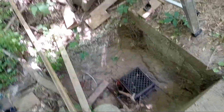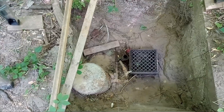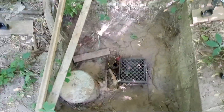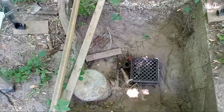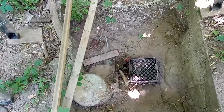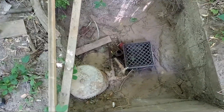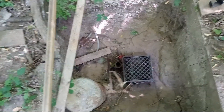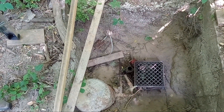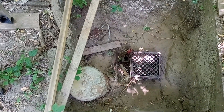Back to the well project. I've been doing a little measuring. I dropped a string with a weight down there and the well is actually 80 feet deep, on the nose — plus or minus an inch. That 80 feet is to the top of what's exposed, so technically it's maybe six inches less than that. I dropped a tape down to the water level and that is almost 17 feet — it was 16 feet 8 inches.